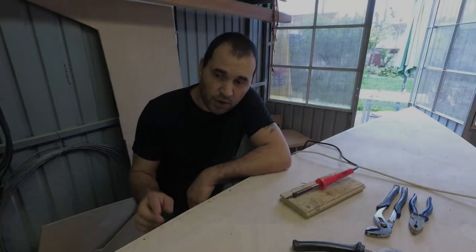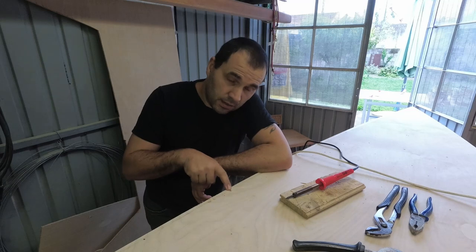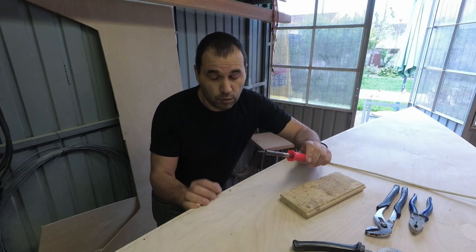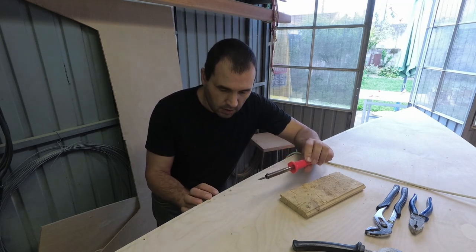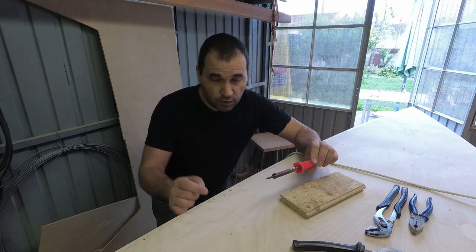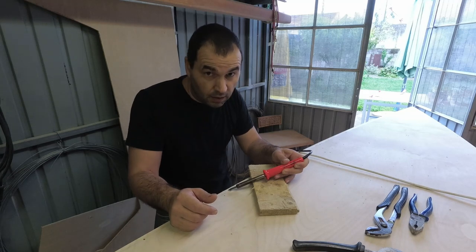While removing the temporary screws that were holding the bottom, one of the heads broke, so now I have a broken screw in there. I'm going to try to heat this up with a small soldering iron, is all I have. If the epoxy gets softer, I will then try to take it off with some pliers. This might take a while.